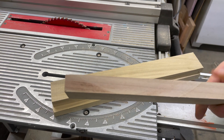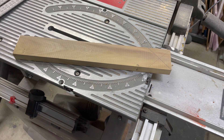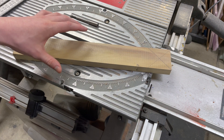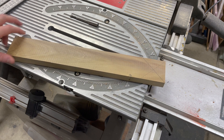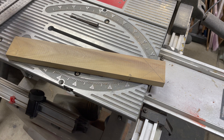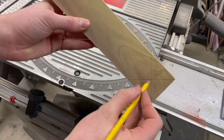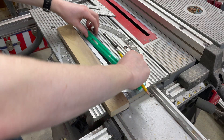I've got a second piece that I'm going to cut right in half, so it'll be two pieces on the sides. This piece needs a slot. I do have a router but I can't find the right bits for it, so I'm just going to drill a bunch of holes and then file it. I need a line perfectly down the center, and this is about two and an eighth inches wide and I don't want to divide that in Imperial. So here's a little trick — I've drawn an X from corner to corner at 45 degrees, and where it crosses is the exact center. Now I can just connect that and I have a line perfectly in the center of this piece of wood without having to measure anything.